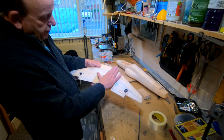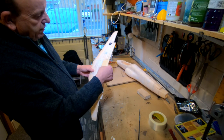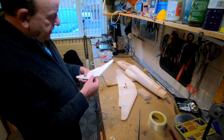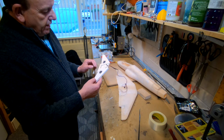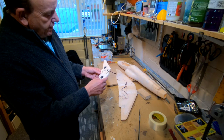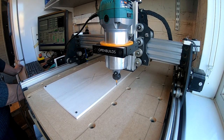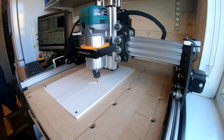I've put the servos on the outside now and I've also put a strengthening ply there, which I need to put some more filler on to get smooth. I also went back to the drawing board on the elevator — I've made a proper elevator and done it on the CNC machine. I did it in Fusion 360, so it's got a carbon rod going across there, and there are some extra pieces with a bit more sanding and filling to do.